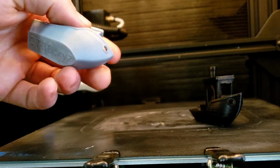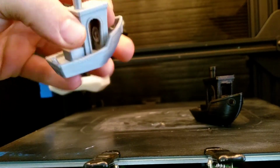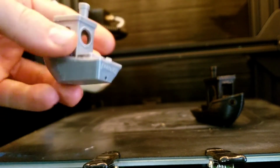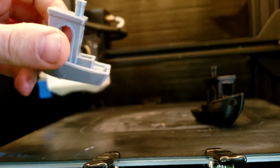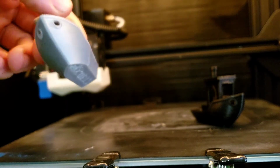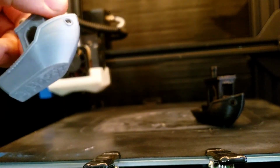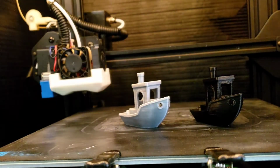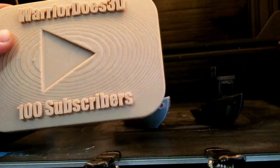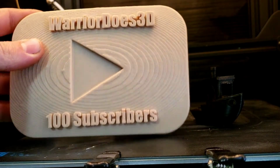We did a few prints. This benchy here came out really smooth, solid, everything's real tight together. And this is still that 0.6 nozzle we're using. And we also messed with some jerk and acceleration settings as well. And this just came out recently, if you guys been watching.